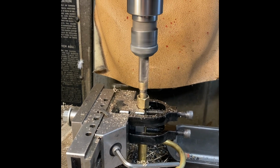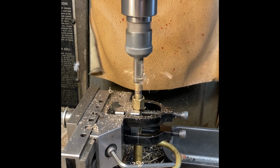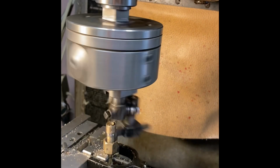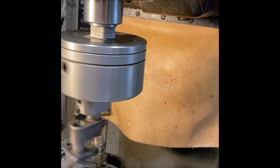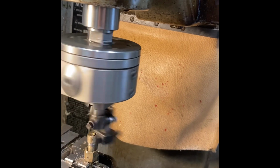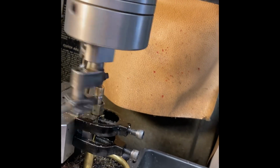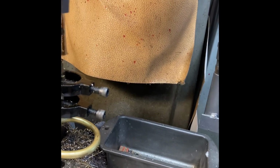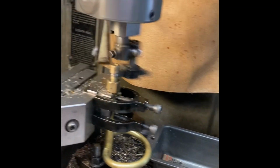And I had like a Wisconsin repair or something. So I had to shorten up the replacement. Here, of course, I had done that, brazed it on. Now I'm facing the end. In this step right here, what we're seeing is I am going through and I'm truing up where the silver braze was, so the nut has a nice square surface to fall against.